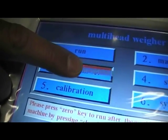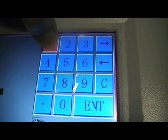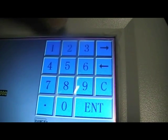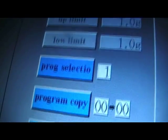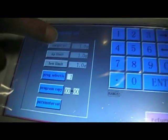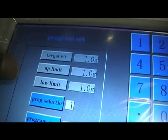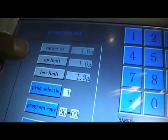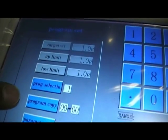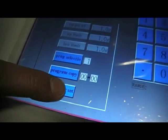Setting the program up is option 3 on the main menu. The password is 1111111. Press the enter key. Here we can select the target weight. Again, these will be the programs, or the values that will be automatically recalled once you open program selection 1 in the main screen. Again, we can set these upper and lower limits to give us overweight and underweights, and we can copy programs if we have very similar programs in terms of weights and limits and so forth. To get into the further parameters for each program, press parameter set,